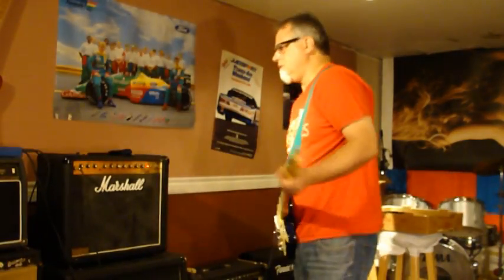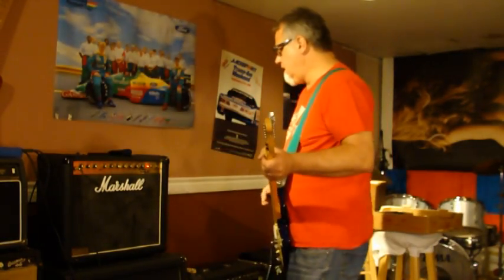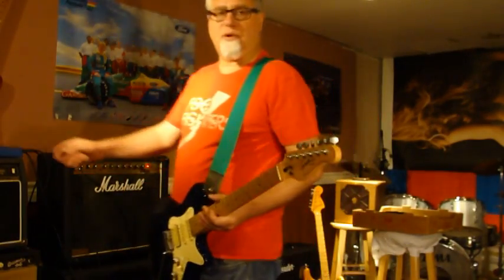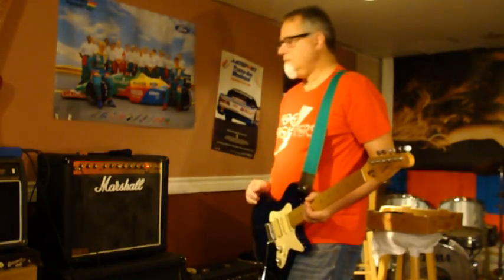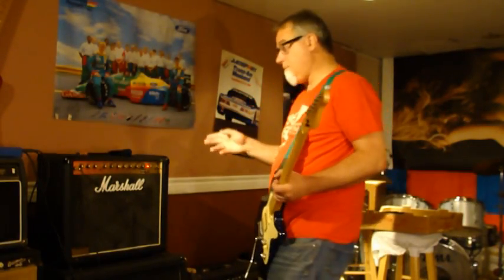But wait, there's more. I swapped out the Electro-Harmonix 12AX7. The 12AT7WC JAN that I had in the phase inverter position, I swapped out with the 12AX7 I had in there, which is Electro-Harmonix, the one I had before.